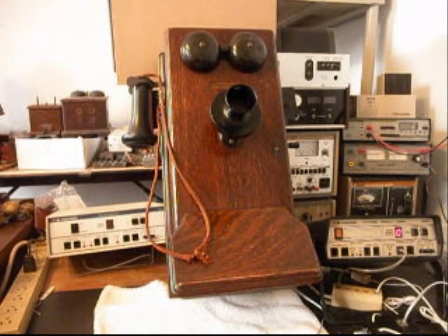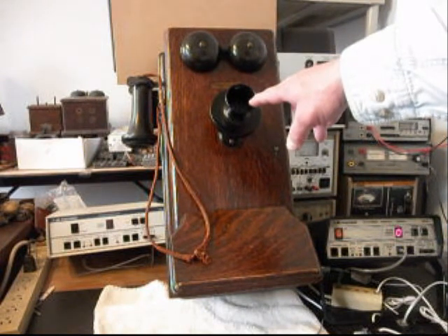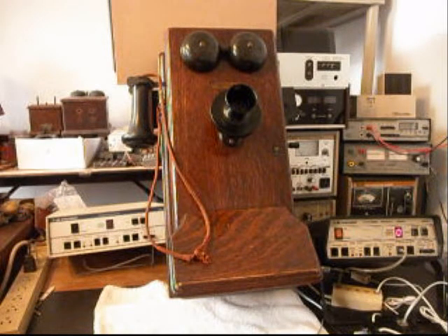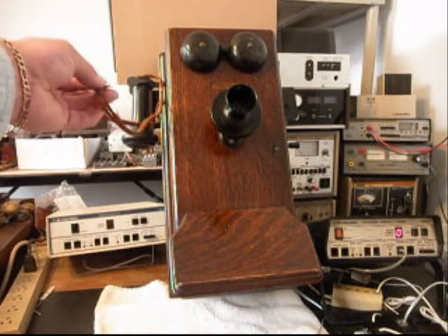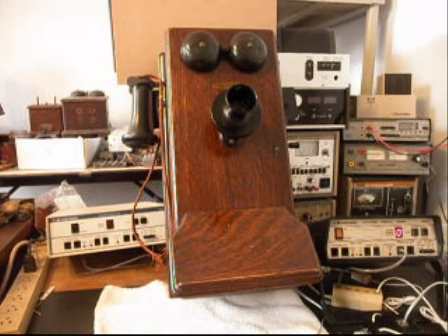The issue now that we want to take care of: we've talked to Richard on the telephone and the original transmitter is not quite up to par — it's not going to be good enough to hold a reliable conversation. So we're going to upgrade. We build and design an electronic amplified transmitter here at the shop and we're going to be installing that in place of the original transmitter. We also want to repair the receiver cloth cord — it's broken on one side and frayed on the other, so we're going to replace all that.